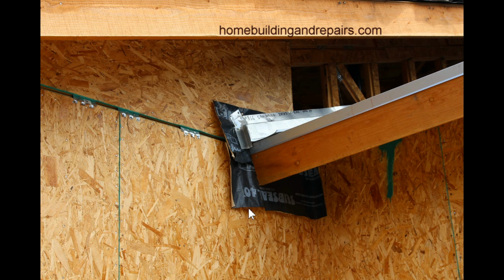Now here it is on another section. We have the roof intersecting into or butting into the wall here, and this goes all the way over. Now, don't forget the lathing paper. When the lather is installing the paper, it will go underneath this section. It's not uncommon to actually see a small area exposed after it's done. That's because someone went ahead and put some paper underneath it and then put some paper over it. So as long as we have some building paper underneath it, and the water can run off of this area onto the next piece of paper and down, we're going to be good.